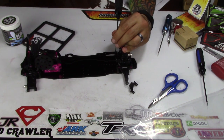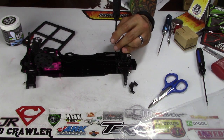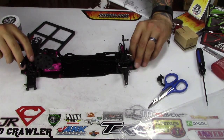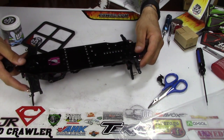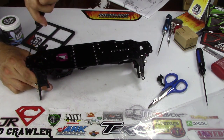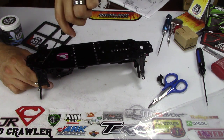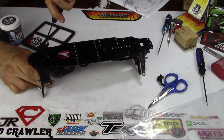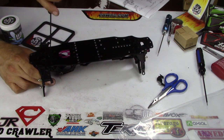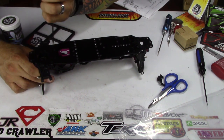And then this has been built correctly on the top and the bottom because, like I said, there is no tweak. Now, what you want to do, remember, as I mentioned before, I did not crank all these screws down. At this point, now that it's together, just go down, give each one a snug. Just make them all as tight as you want them to be now because the whole thing is put together and you have not twisted your chassis at all. So just go through on each screw, give them all a little bit of a snug to make sure that everything is locked into exactly what you desire.